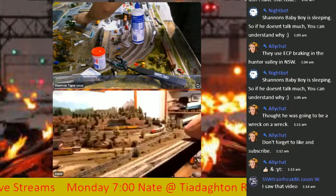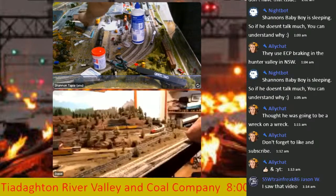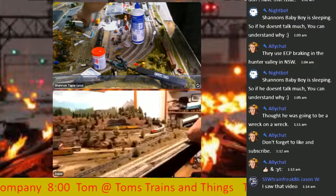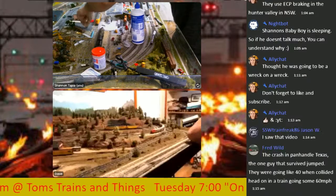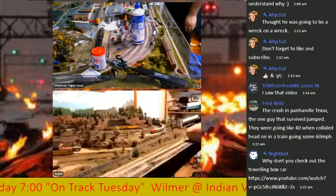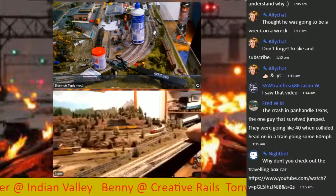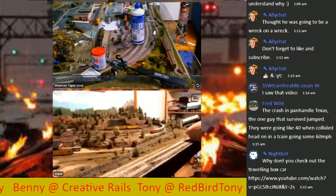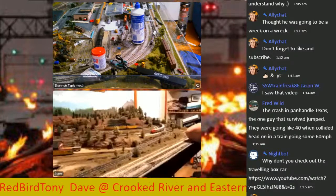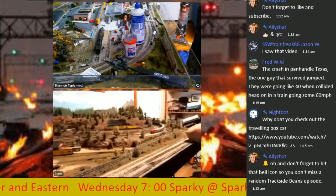They had a camera on the eastbound train that was going in the pass, and you could see the signal that he had. He had a red over green, which meant that he was lined through the siding. The westbound train had already cleared that switch. So the dispatcher had lined that eastbound train through the siding, and you could see the signal change from a red over green to a double red. By that time, I think the turnout was 40 miles an hour. And the other train had just hit the foul, and it was a massive head-on wreck.